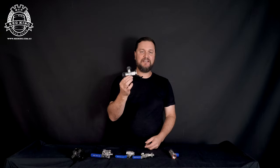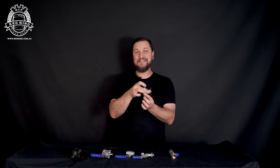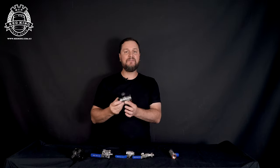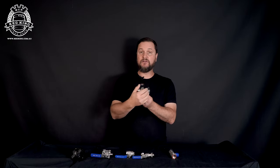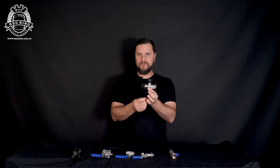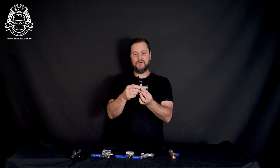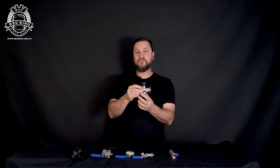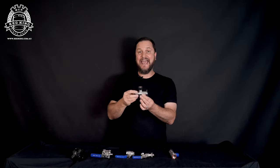So why would you get an aseptic valve? Simply because if there's anything trapped behind here, it's actually just sitting in sanitizer or ethanol, whatever you choose to use to keep things sanitary behind the valve. It'll be closed against the tank, so the tank won't be flowing into it, waiting to be opened. So when you're ready to use it, you just run the sanitizer out, take your sample, close it back up, or rinse it first once it's closed against the tank, and that's it.